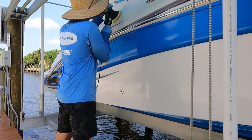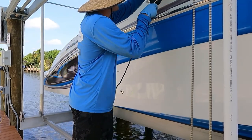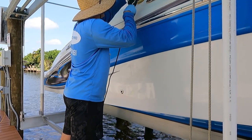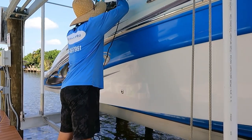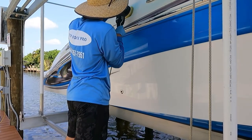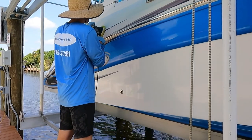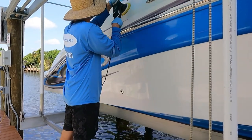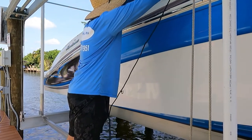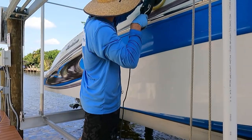If you take your phone flashlight and shine it directly up to the gel coat and move it around, you want to see your reflection clearly — you want to see your face clearly in that reflection. If you can't, that suggests there is a little bit of oxidation. If you have super light oxidation where the boat still looks shiny but not a perfect showroom-flawless glare, you'll want to go with the microfiber pad for the waxing process.